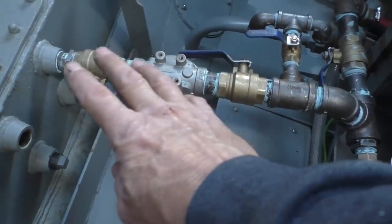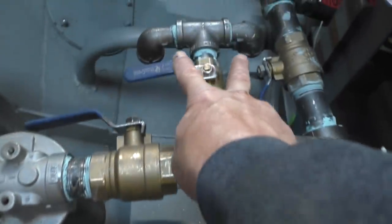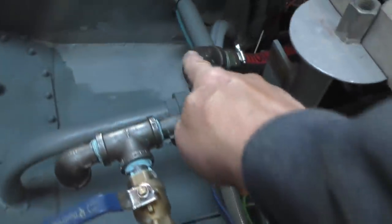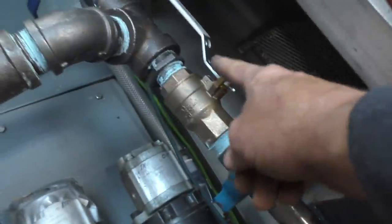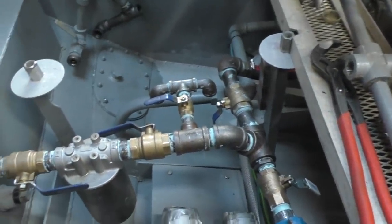That's a perfect tool. Okay, now we have three separate sections to the hydraulic system in here. This is the first section. This supplies the hydraulic fluid from the tank to the various pumps. So these two pumps down here take off that one right there, and we can shut them off if need be. This comes down and tees, goes back around that direction, down the hose to that big pump that sits on the main engine. And if that hose leaks, well, we can shut it off too. And then one more coming this direction, turns the corner, and a VMAC will sit right here. It has a hydraulic pump on it, so it'll take its fluid from the end of that line. And if need be, we can shut that one off too.